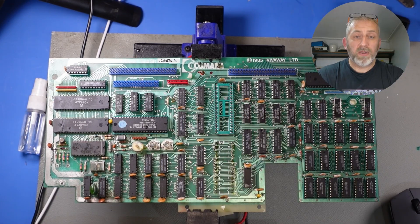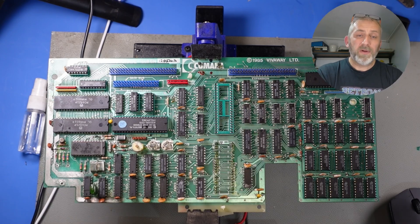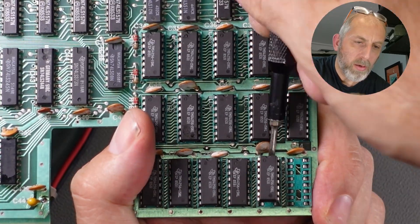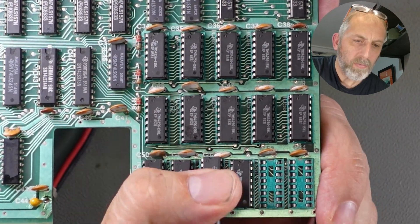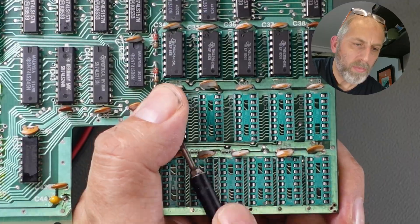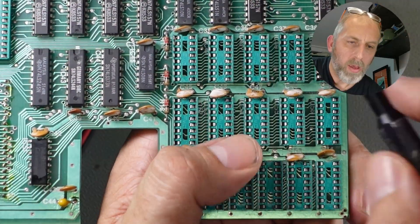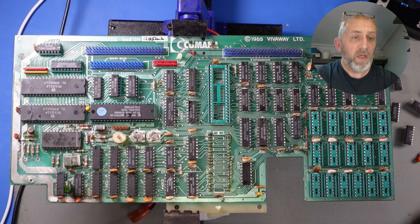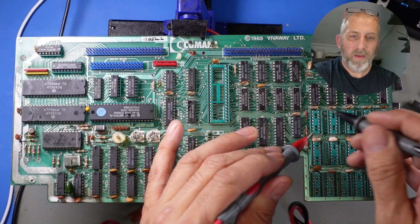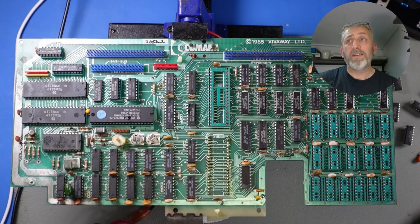The next thing I'm going to do is remove all these chips. Somebody did suggest that, but I couldn't quite find the comment. We're going to start by removing this bank of memory chips here. That's all the memory chips removed — let's try again. And it's still there. It's even shorted across here, it's got continuity. That to me still doesn't seem right. What do you guys think? Drop a comment down below.